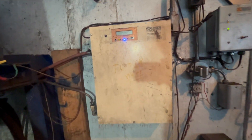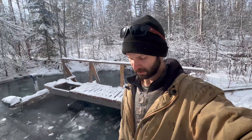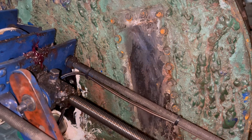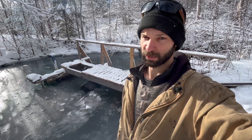We just turned our power plant on. The amount of power we're producing is a little low compared to what I would expect. Bearing temperatures climbed rapidly from 45°F up to about 70 and 90 degrees within five minutes. Water is not actually coming out of the casing, but our plant is now full of water because water is coming through our wall somewhere. Pressure in the pipe is below where it should be. Low pressure plus water escaping into the building indicates a small crack, failed glue joint, or something of that nature eating up our pressure. I'm going to have to go back into the ground in more favorable weather conditions and do some digging to figure out what's going on — which is disappointing, but it is what it is.